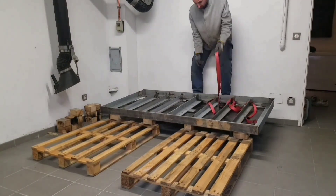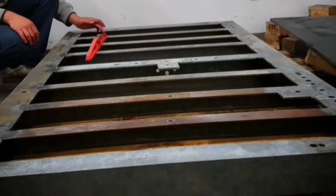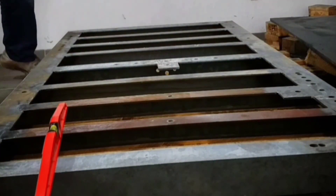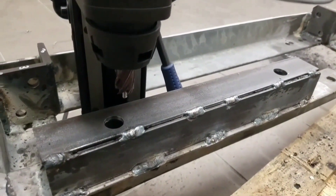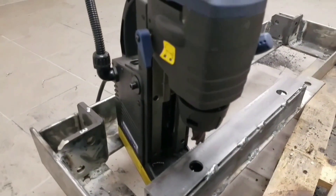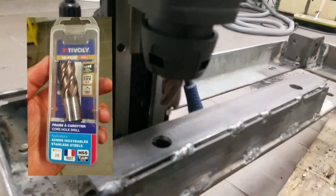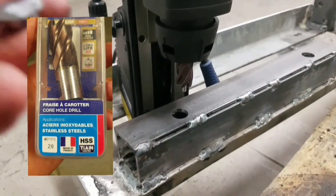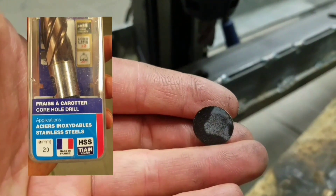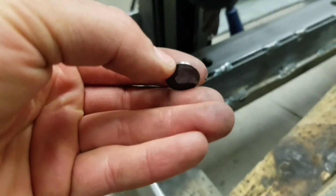It's time to flip the frame — with all the reinforcements I've added, it's starting to get heavy. A quick test confirms all the angle irons are at the same level. I welded two angle irons to allow a tube to slide through, and I bored two holes — you'll see why shortly. I used a Tivoli hole cutter — it's ultra efficient. The hole comes out really clean and very quickly: the cutter leaves a small slug that pops out, and in just a few seconds you have your hole. Nothing like regular drill bits.